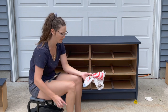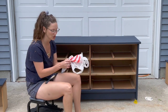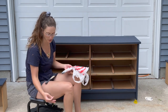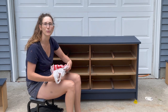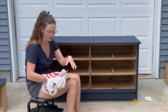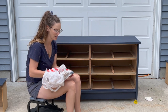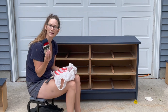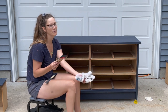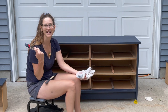Time to go in for my second coat. I've got my paintbrush in a plastic bag — a little tip: in between coats of the same colour, you can put your paintbrush in a plastic bag, put an elastic band around it to keep the air out, and pop it in the fridge. It keeps your brush wet in between coats, which means you don't have to wash it out. I really dislike washing out brushes, so I love this tip.